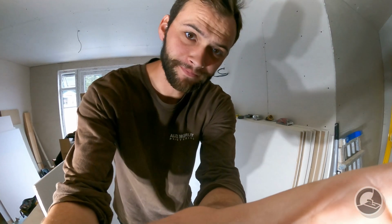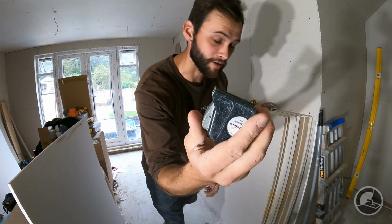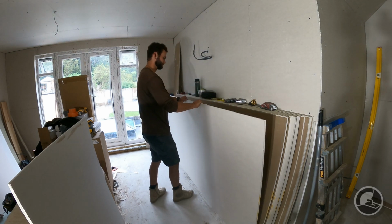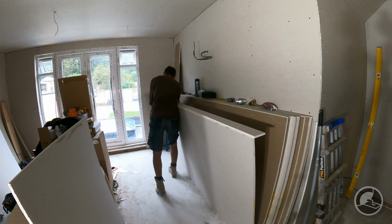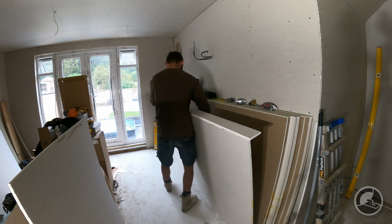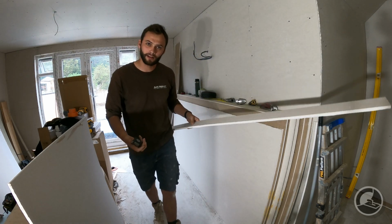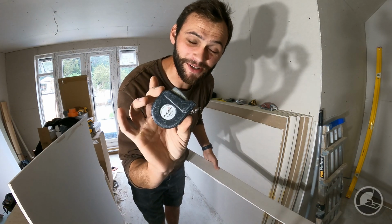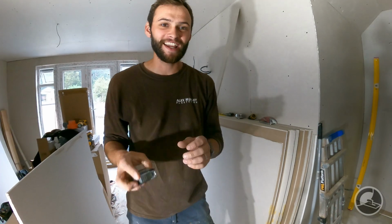It's awesome. What's more is, if you're being really lazy, and as most people who watch our channel know, I am lazy, check how you can even use the tape measure, close it up, snap it like so, and then just use the tape and just run it along the join there. Job done. Don't even need a new Stanley knife. Tape measure can do the whole thing. So as a hybrid way of cutting boards, it is very, very effective.